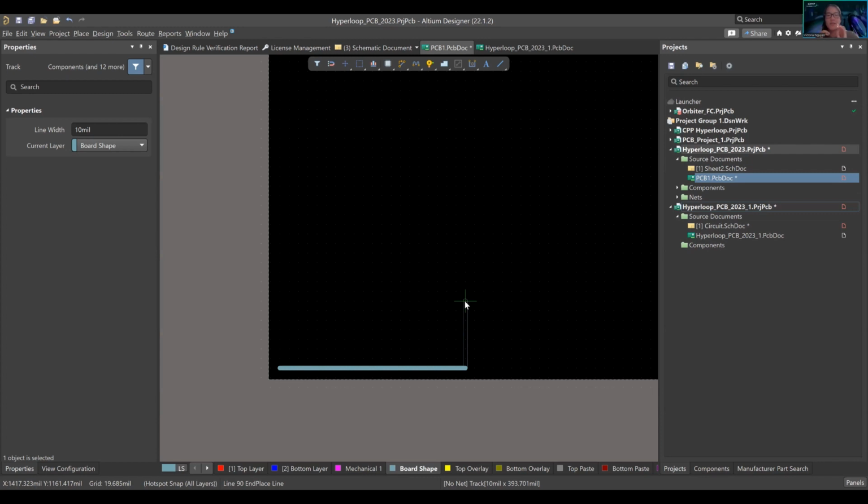Okay, now you're good. But also, specific to copper, when it goes at a 90 degree angle, it can become an issue for EMI. If you have a whole copper pour and then it has an angle right here, a bunch of voltage can sit in the 90 degree area, which becomes a really big problem for EMI, right? Because lightning is going to want to jump directly there. And we're like, no, we don't want you to jump anywhere, but we gave you space to do that. So something to think about.